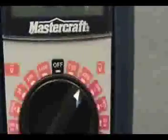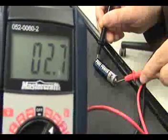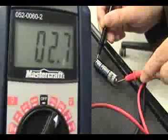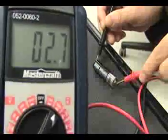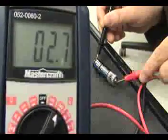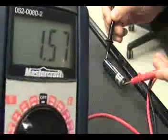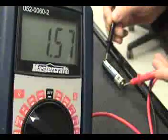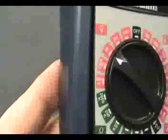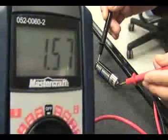We've got it on alternating current and Ms. Tung is touching both ends — we're getting a wrong reading. This actually happened to me once and I couldn't understand why. You do not measure a DC battery with the AC setting. So I'm going to switch it to direct current now. Ms. Tung is touching it — what do we see? 1.5. That's an accurate reading because it's DC. Be very careful to pick DC for batteries. The meter says about 20 volts, so anything under 20 volts will work. The battery is reading 1.57 — it's got a lot of juice in it. That's how you use a voltmeter to check voltage.